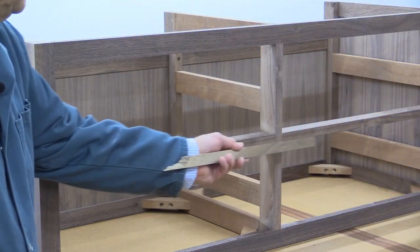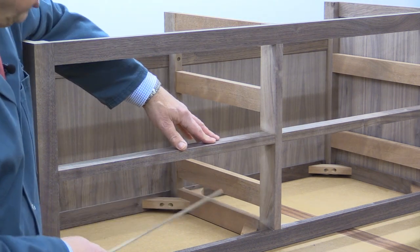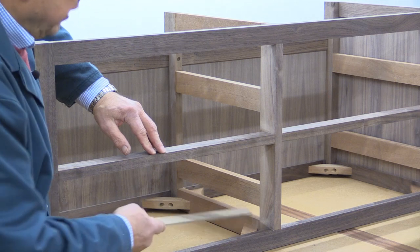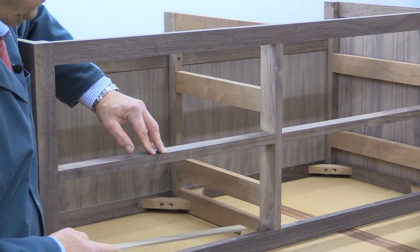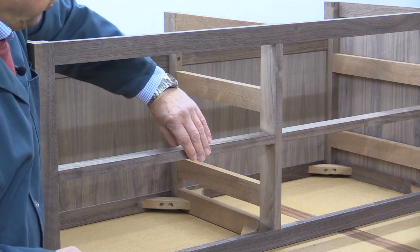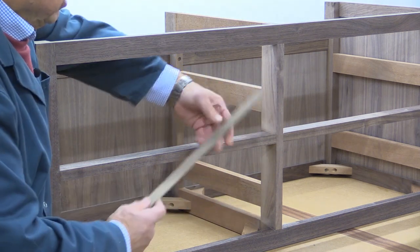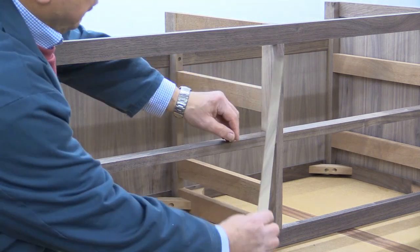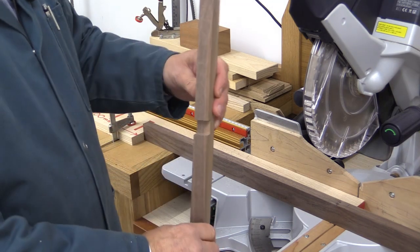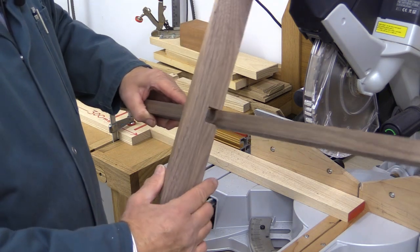This central stile and this rail are joined together with screws and some overlapping joints, which I'll show you in a second. There are two screws — one at the top and one at the bottom — that come in from the rear and screw into the bottom and top rails respectively. The third screw comes in from the front, screwing through this piece into this stile, and to hide that screw there's a strip four millimetres thick of wood at the front, put on at the very end.